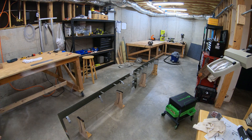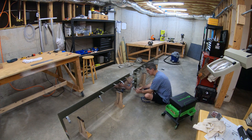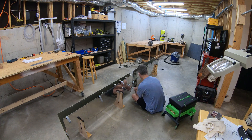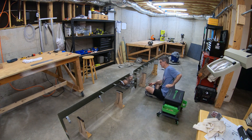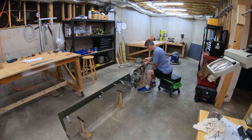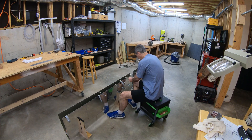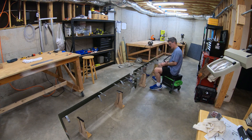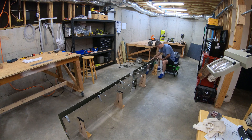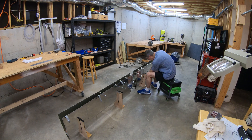Now I've got the left and right halves down on the floor. My wife and I have already put the substructure — consisting of the front spar web, stringer web, and spar ribs assembled in the last video — down inside between the skin halves. So really I'm going from two halves of a stabilizer to one big twelve or thirteen foot long airplane part. I've committed to assembling the rest of this on the floor. Most people would have it on a table with cradles clamped down, but I realized I'd be spending an awful lot of time standing on a chair or climbing up on a stool.